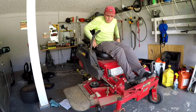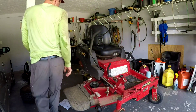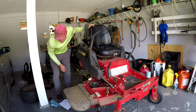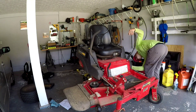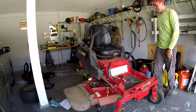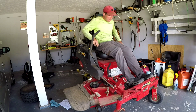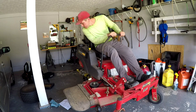I mentioned at the end of the video that I needed to add some fluid, but actually when I took the caps off they were both at the perfect level. Because once I put the two quarts in it was above the full mark a little bit, and then once I ran the mower it was at the perfect spot. So if you do right at two quarts it'll be perfect. With the motor still running I'm just checking to make sure there's no leaks or anything.